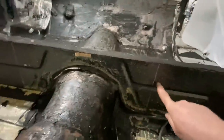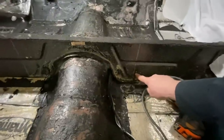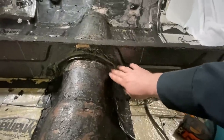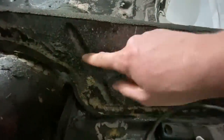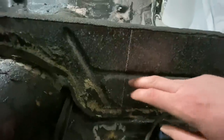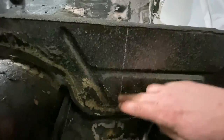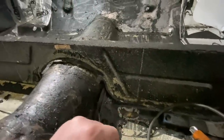So I've just laid out some lines here and here to cut this out. The reason I picked that particular spot is to give us lots of room to work in here, and when we go to weld this back in, this is the easiest spot to weld. We're not going to be interfering with any of these body lines. We just got the one line right there - nice and easy to get to and we can grind it nice and smooth after. I always try to plan like 10 steps ahead when I'm cutting stuff. You got to remember, you got to put it back together. So pick the easiest way.